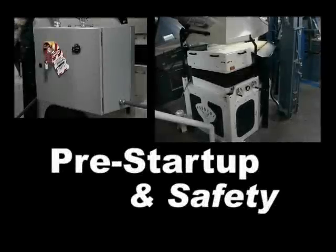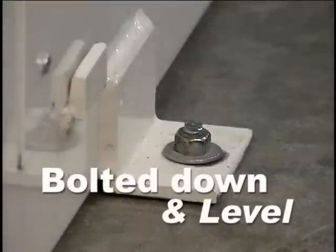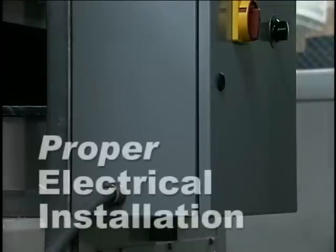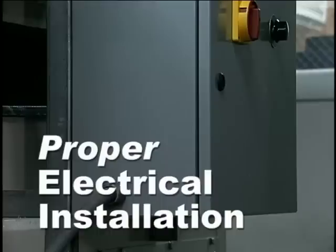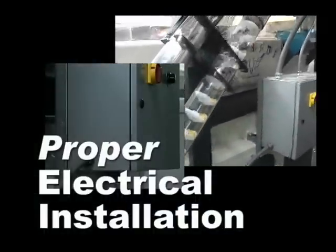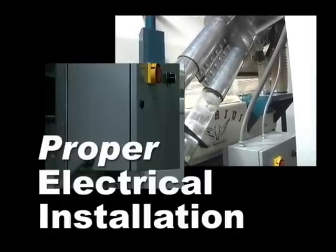For performance and safety reasons, you must verify proper installation of the Pegasus prior to its use. The Pegasus must be permanently attached to a rigid concrete surface. Check that your gravity table is level to the floor across the length and width of the machine and that all anchoring bolts are securely tightened. Use caulk between the machine and concrete floor to facilitate easier cleanup. Confirm that all electrical connections are made in compliance with applicable codes, and verify that the fan is turning in the labeled direction when energized. Adequate grounding of the Pegasus is necessary to prevent a buildup of static electricity on the deck, especially for products such as canola and flax. The discharge of static electricity from an improperly grounded machine can be a significant safety hazard.